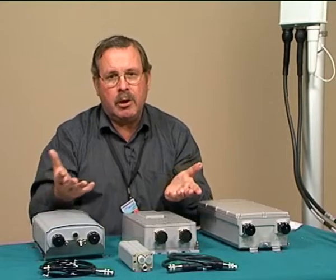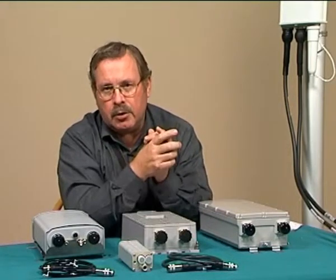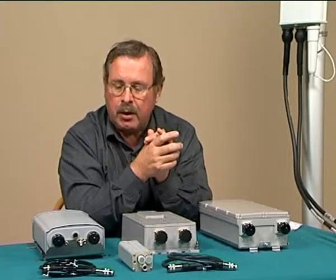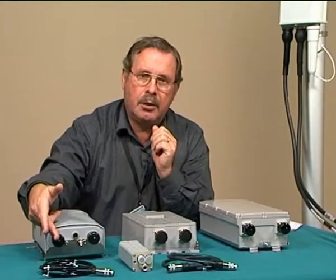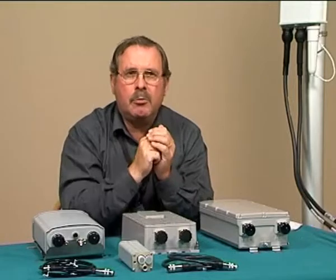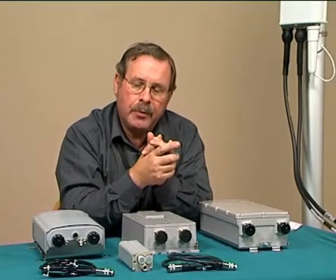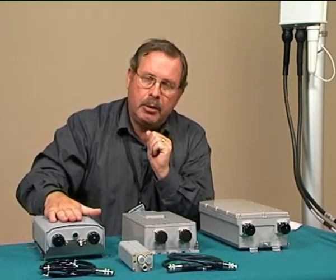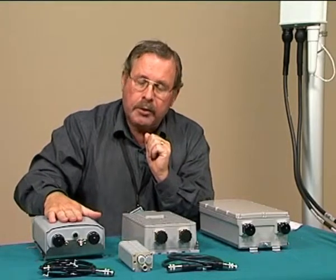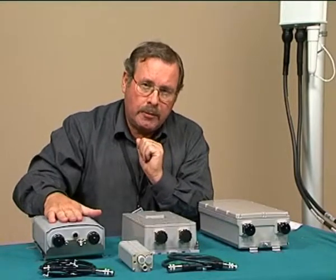If you should become involved with testing a radio system after it's been installed and put into service, you simply cannot come to the unit to disconnect it or change it by dragging out the cable. That's something like switching off your PC by pulling the plug out of the wall. What you have to do is to disable the unit, to block it in the base station itself, and that's a job done by the radio engineer.